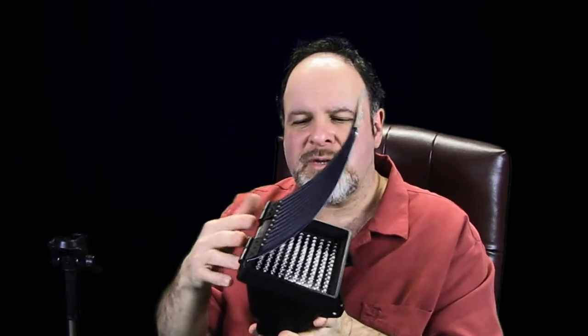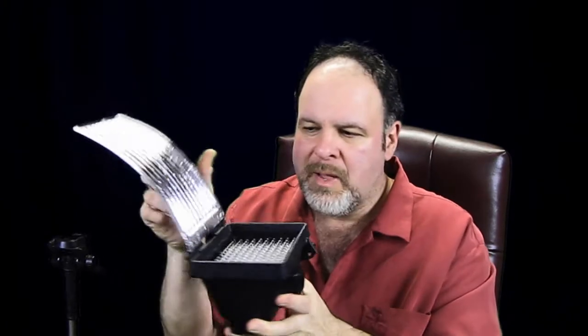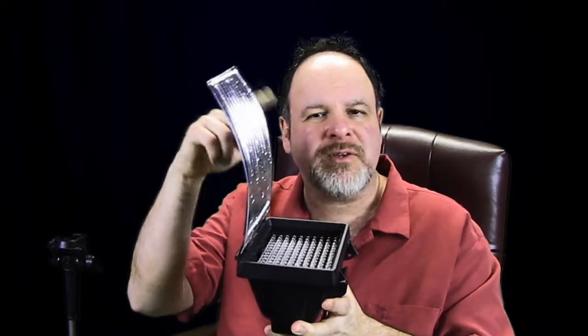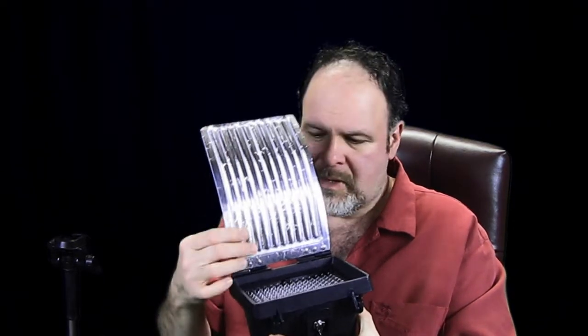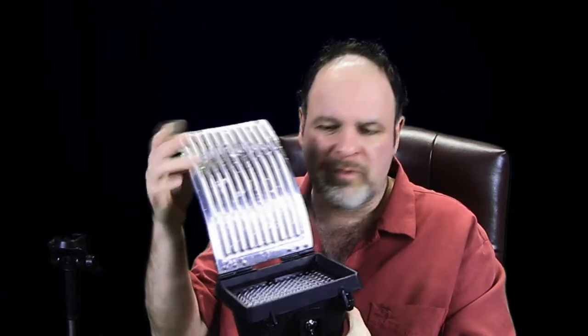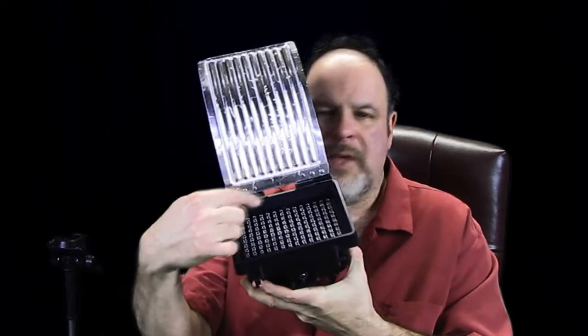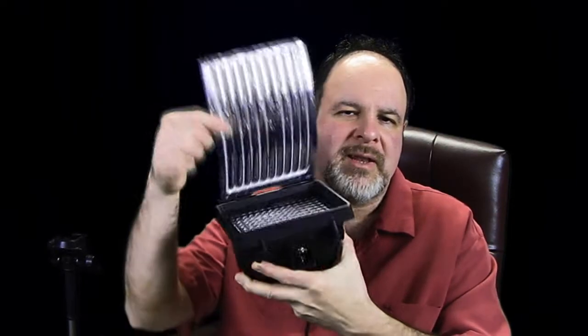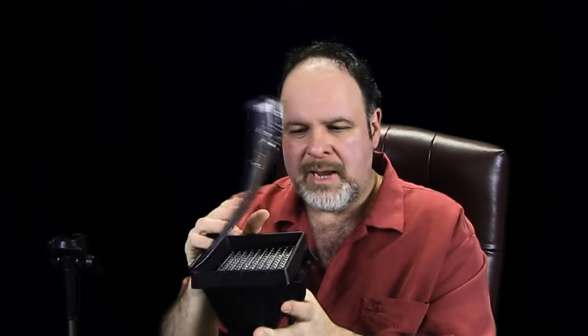It's just a hinge riveted on to the top piece of aluminum, and you just approximate the curve. You can melt a piece of plastic into it, or use a piece of cardboard, put on that reflective ductwork tape you can get at any hardware store, and put a little mechanical stop here. I just put a little piece of rubber inside this so that it goes no more than 45 degrees on it. And this worked really great, as I'll show you a demonstration of some video.